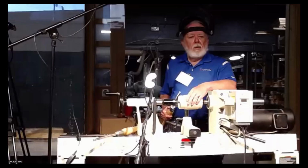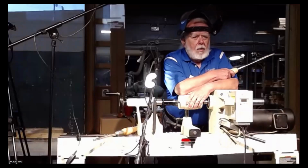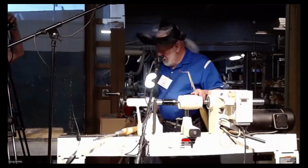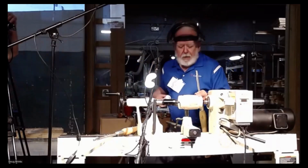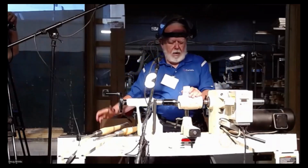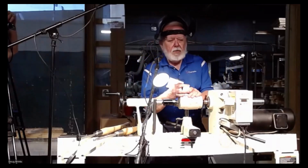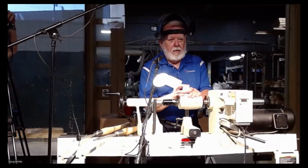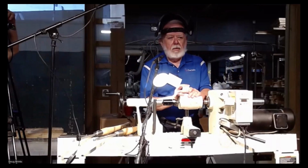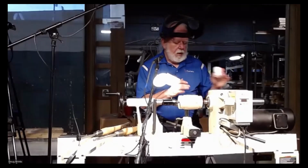But that's shear cutting. A minute ago, when you were really hogging on that thing, was it the size of the cutter being so small, or you going in 90 degrees? Yeah, I was going in at 90 degrees, and let me get my cutter. Now, all of a sudden, I'm cutting with that much of the cutter, okay? That's a tremendous amount on these shear cup cutters. It's a design of the cup that has to do with it.